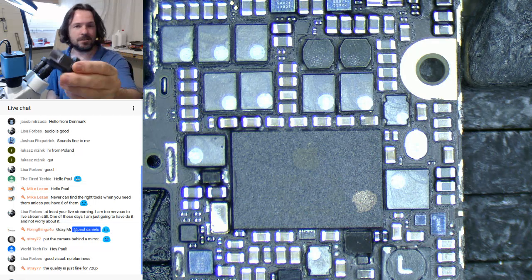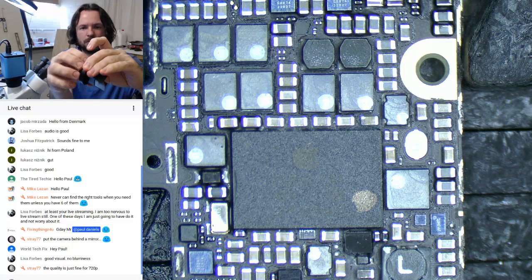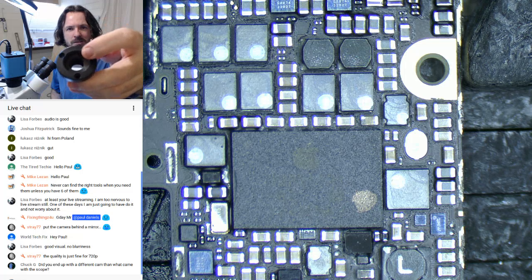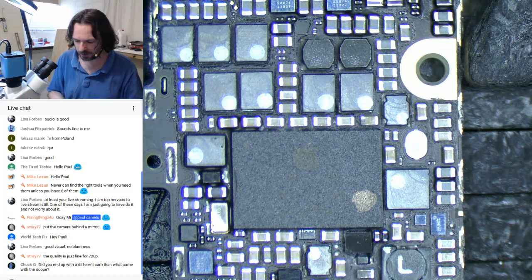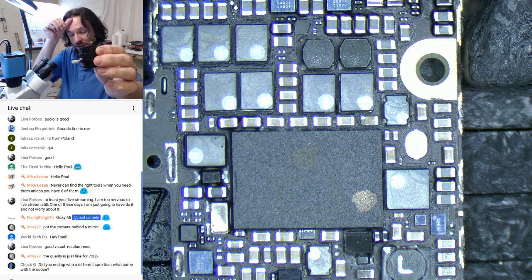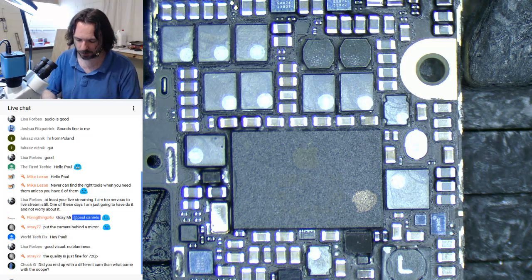Okay. This here is what used to be supplied on Amscope trinocular heads, whether they be simulfocal or otherwise. It's just a typical sort of prism, split mirror prism, whatever. And the main thing is it's got a threaded insert here. Whereas the new Amscope ones don't have threads. It's just a larger, open, threadless sort of setup, and you've just got one grub screw that holds in the dovetail. Now, I bought myself an adapter, a 0.35 adapter, which is this contraption here, which gives you a decent field of view with this particular camera, because this camera has a 1/3 inch sensor. And yeah, this one here has got a threaded base. Now the problem was, even though this matches that other insert, I bought that insert separately.